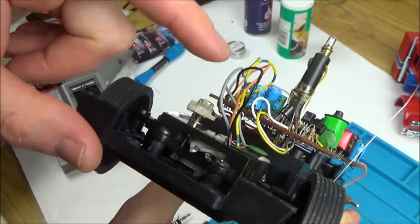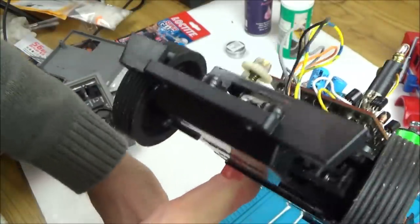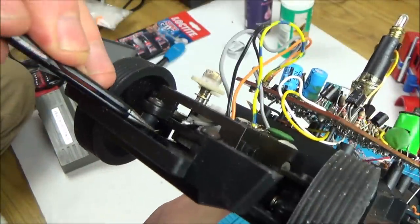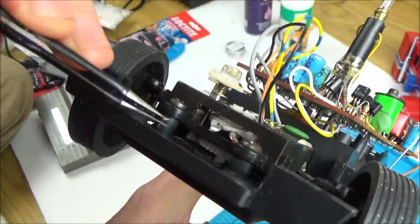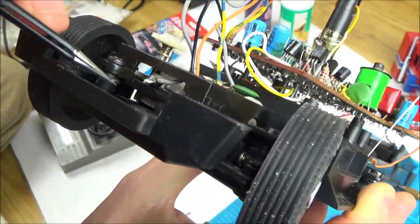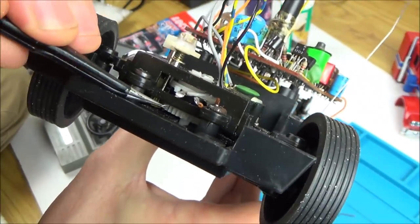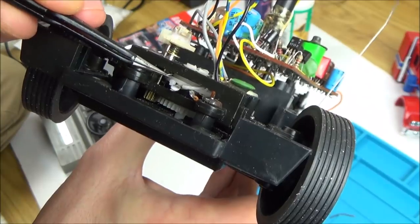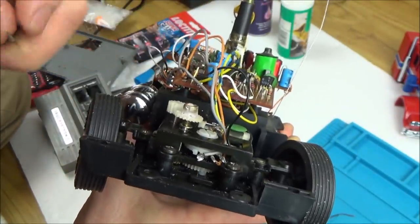So then what happened was, I brought that down to the gear, the gold gear at the bottom down here. Hopefully you can just see that in here. Basically that was working perfectly, but all it did was shove the problem along one. This gear here then started to skip every time it met resistance against this gold gear. And annoyingly, this gear is attached to this potentiometer. So this is the thing that must tell it to stop when it gets to a certain level.